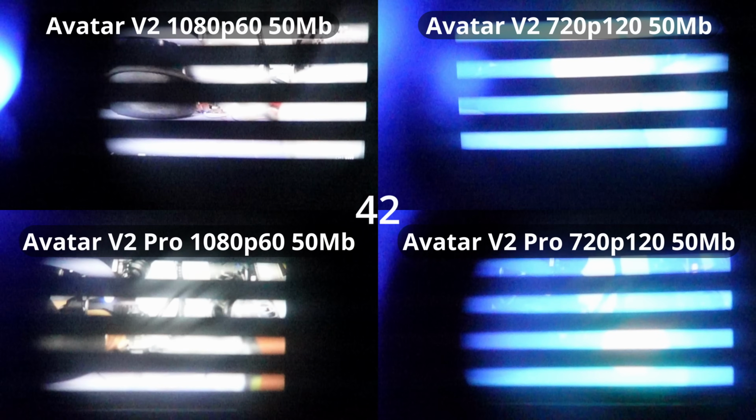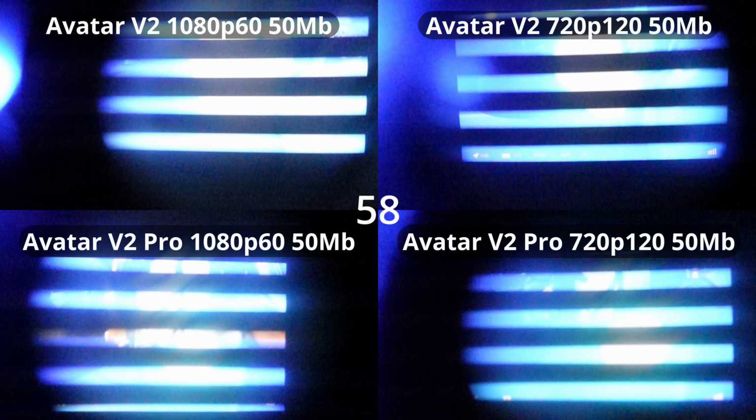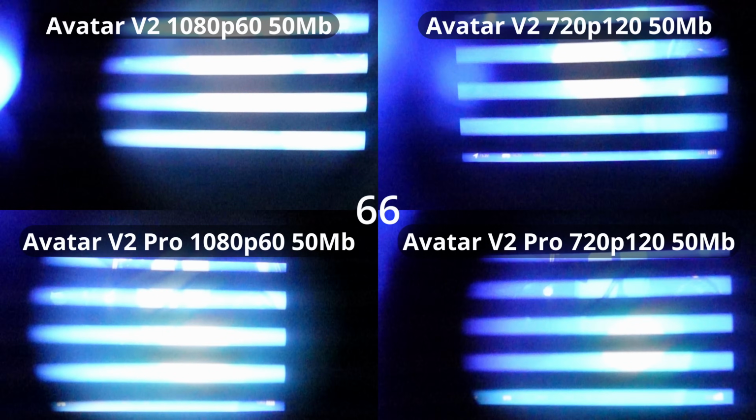This footage is captured at 1000 frames a second with the LED in front of the camera turning on at time 0, and then we can wait and count the number of frames until we see the first bright pixels on the screen, and then until the entire screen has fully updated. And that gives us the glass-to-glass latency for a single pixel and also for a full frame.